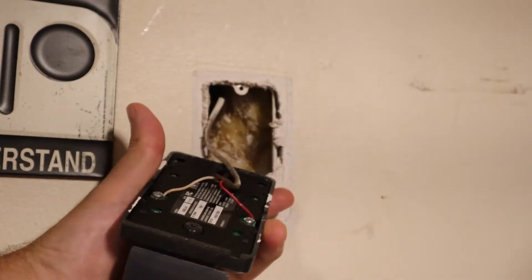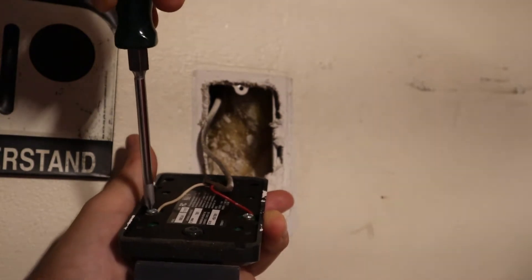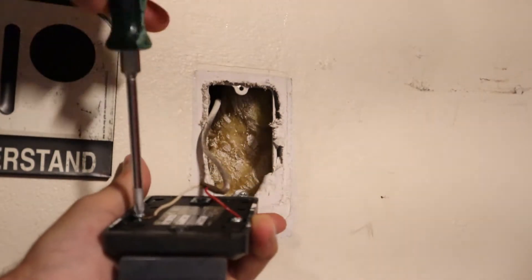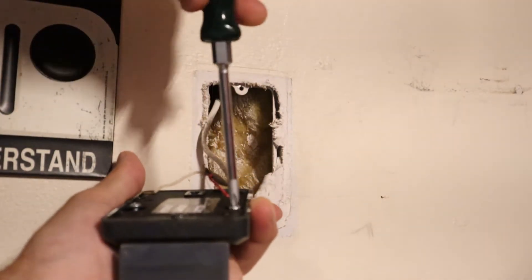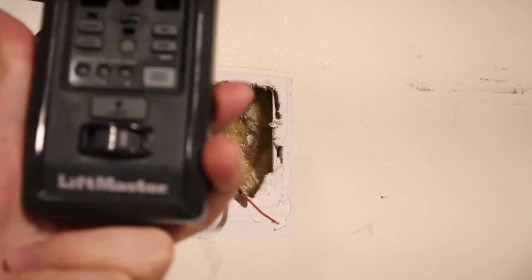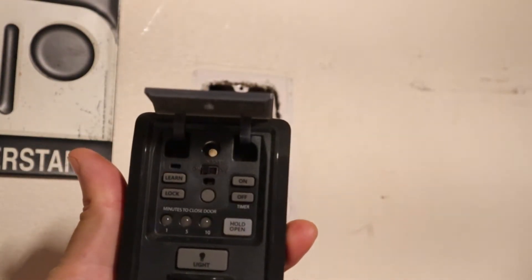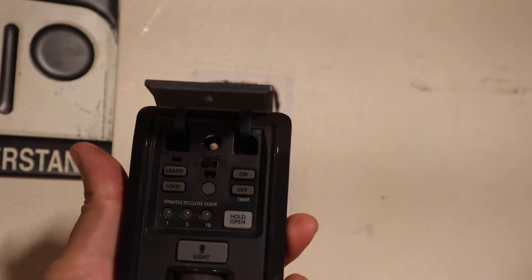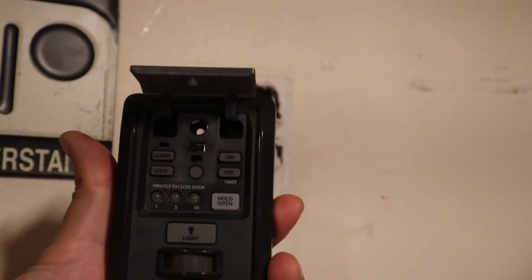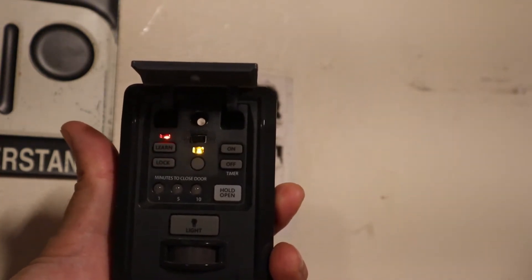I got the unit off — we're just going to remove these low voltage wires. Now once you remove these, this light should stay on for a while. See, it's flashing now. It should take a while to die off because this device doesn't have any power right now. So the super capacitor that may have failed is what's powering this right now.